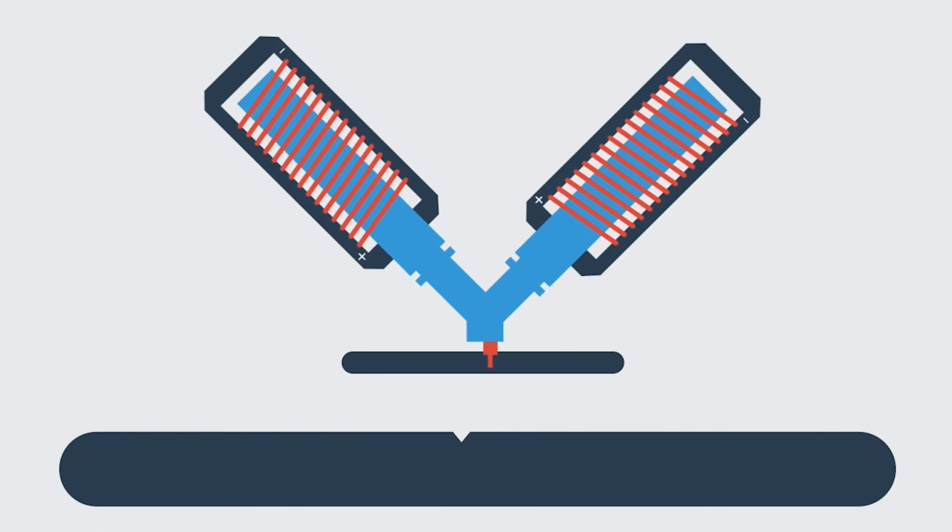By this point, you've probably already figured out how we get those grooves onto the disc in the first place. Instead of allowing the stylus to vibrate and generate an electrical signal for the amplifier, we send quite a powerful current through the head, which makes the cutting stylus vibrate and etch grooves onto a blank disc.